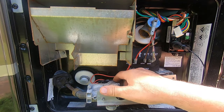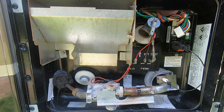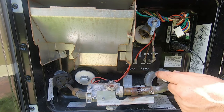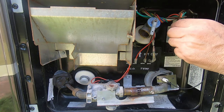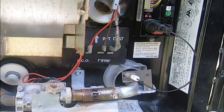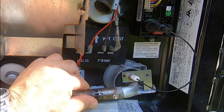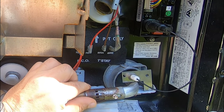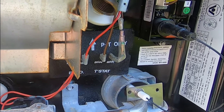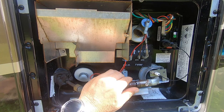I've turned the switch to gas on inside, and I've unplugged the control board so I can plug it in and activate it from out here. We're going to see if this lights. This thermal fuse was a problem, but I think I cleaned that up. The sparker does have a crack in it, so that may still be a problem, but we're going to plug it in and see if we get any power or gas. Oh, it lit right up! You can see it. Oh, it's stuttering a little bit. We're going to close that a little bit — you see how loud that was? And as you can see how quiet it is now. That flame is solid blue and running perfect.